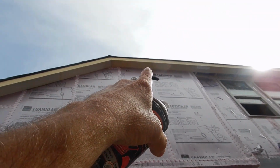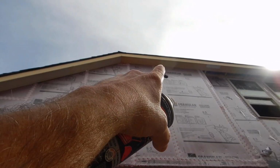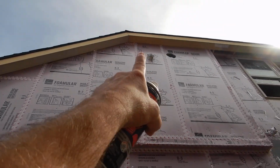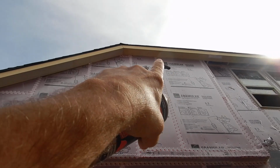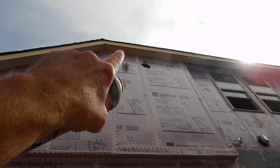We've got an opening. That's the fresh air induction vent, and there's an opening where they originally tried to put one, and they left the hole there. When you're in the attic, you cannot see that hole because of the duct going to this. So that's hidden. From the inside, there's no clue that you've got this gaping hole. This hole needs to be sealed.